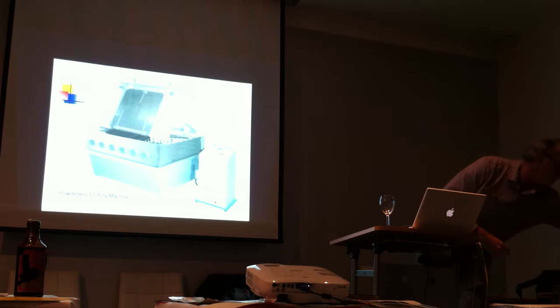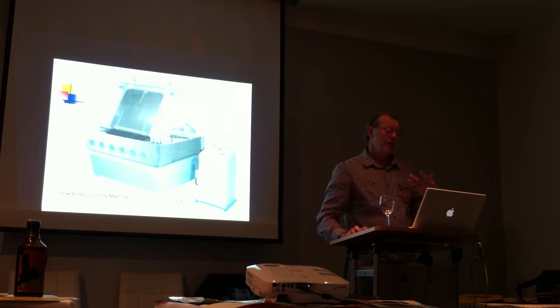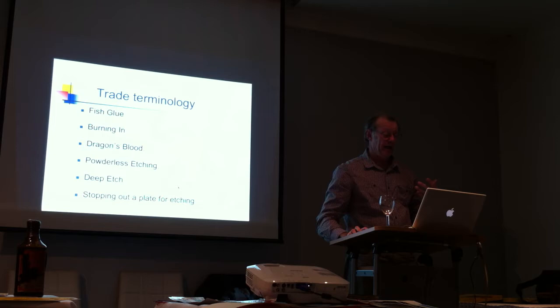Now, they were paddle etching machines. We etched on some of the things we've used, which was actually zinc, magnesium. There's a magnesium printing plate there. They used nitric acid. Copper plates used, I think it was chromic acid. No, it was a different acid for that, but you had to use plastic bars and porcelain bars because there's no equipment that would eat into it. So copper used a different acid, again, the same principles.